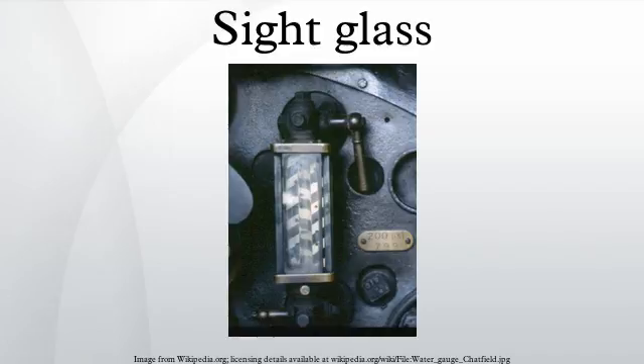The modern industrial sight glass is a glass disc held between two metal frames, which are secured by bolts and gaskets, or the glass disc is fused to the metal frame during manufacture. The glass used for this purpose is either soda-lime glass or borosilicate glass, and the metal, usually a type of stainless steel, is chosen for desired properties of strength. Borosilicate glass is superior to other formulations in terms of chemical corrosion resistance and temperature tolerance, as well as transparency. Fused sight glasses are also called mechanically pre-stressed glass, because the glass is strengthened by compression of the metal ring.